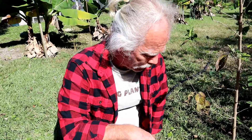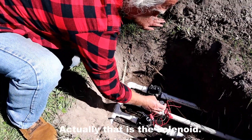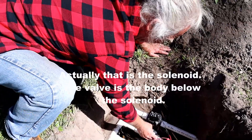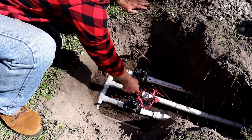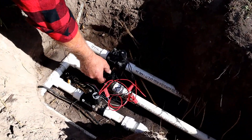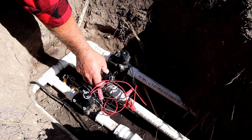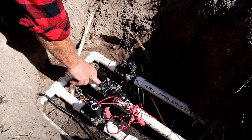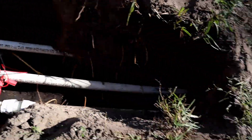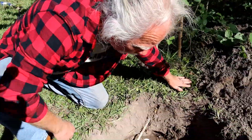Right now this is three of six - I've got actually six different zones that provide water with sprinkler action that goes on a timer. Now the way these valves work is that it sits on top here and it's electrified. The water pressure closes this valve, and then once you put electricity to it, it opens up the valve and allows water to flow from the supply side out to the actual sprinklers themselves.